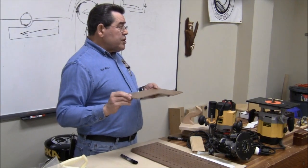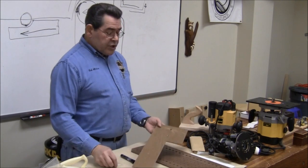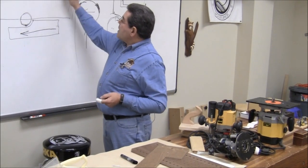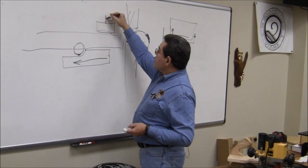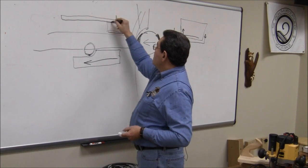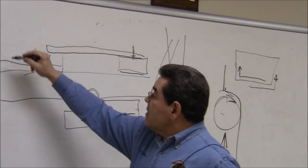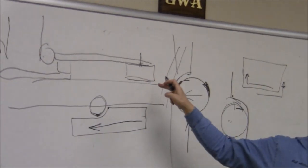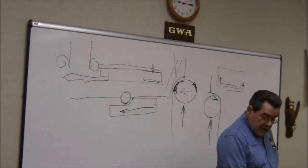If you need to do this on a piece where you can't afford to have a locating pin hole, you take a block of wood, double-stick tape it to the workpiece, and your pin comes through there. Then you have an extension arm, spacer, and the end piece that holds the router. Now you've double-stick taped this to the center piece, and it will pivot just like the other method does on a pin.